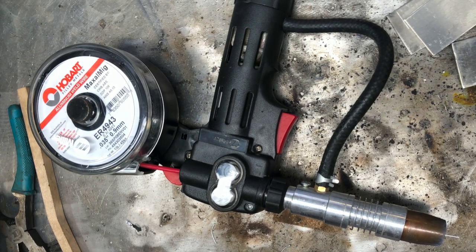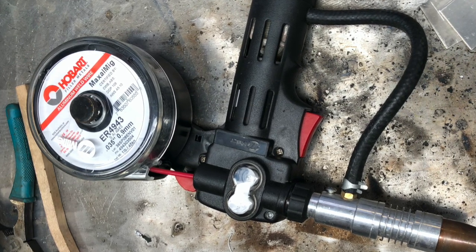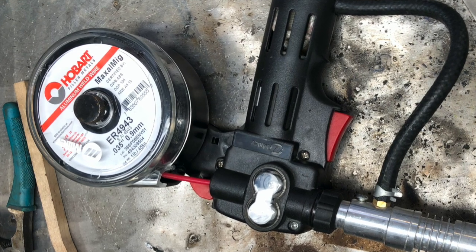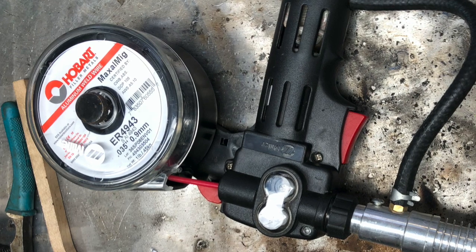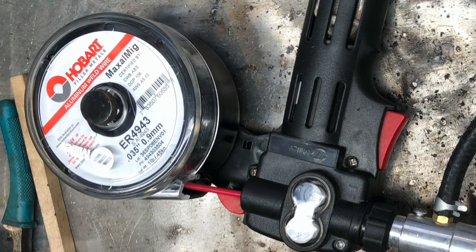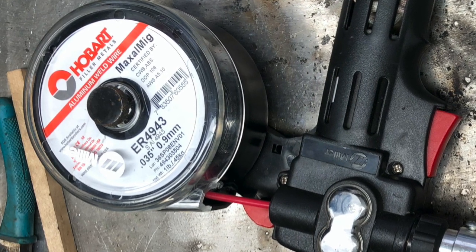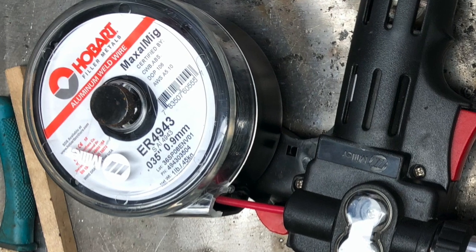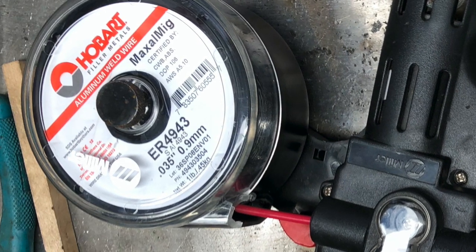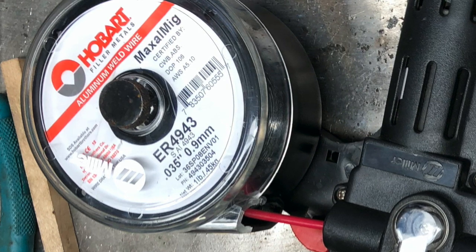The Miller 211 is an absolutely great machine, totally designed after the KISS concept — Keep It Simple Stupid — but it will not let you deviate from the synergic curve. So when welding with 4943 wire that requires more voltage, it's always a little cool, a little crackly — not a full spray arc, borderline short-circuiting. I wish you could dial up just an extra volt and have it spray real nice. Maybe a helium mixture would compensate for it running too cool since you can't adjust the voltage. Overall it welds fine with the alloy it's intended for, but with the new hyper alloy you can't adjust the machine enough to compensate. All in all I had a great time at the seminar, I learned valuable information I hadn't learned before, and I'm glad to pass some of it on to you. Thank you, see you next time.